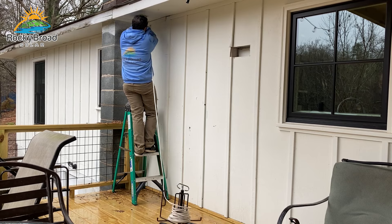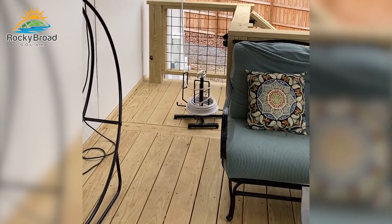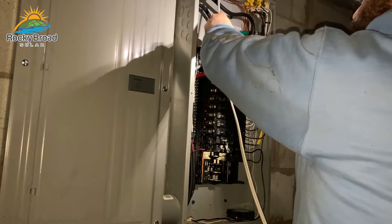One critical tip if you're not used to pulling wire: buying a wire spooler is really going to be in your best interest. They make them to hook on a two-by-four stud, which contractors use for new construction. I used the floor standard mount — as you pull wire it unspools so you won't have a rat's nest. Everything comes out in one nice clean straight wire that can be stapled in neatly, and it saves you from needing a second set of hands.